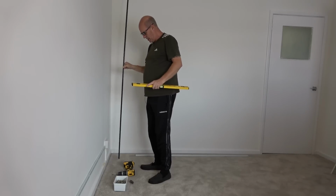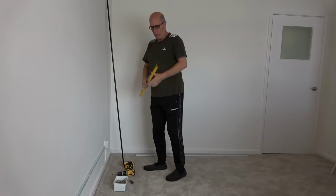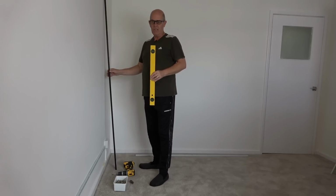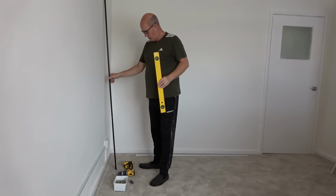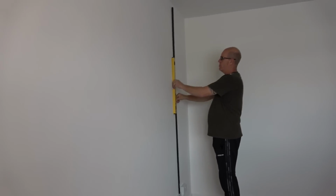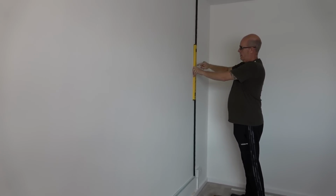Now, because we're using quite a lot of weight on this shelving with our tanks, when they're all full up, they're actually going to be quite heavy. So what we do is most important. We put these roughly, I have mine roughly 2 feet apart, 2.5 feet maximum. And then what we do is we measure them out at 2.5 feet intervals. And then when we place them on the beam like that, we level them up using our level. We get them to a point where they're absolutely upright, and then we can mark our holes correspondingly